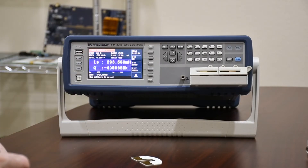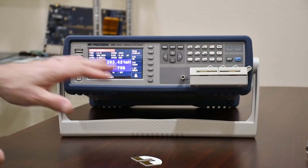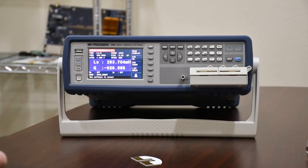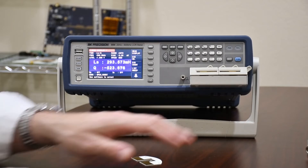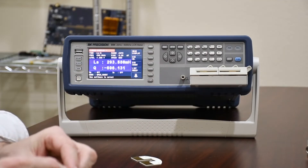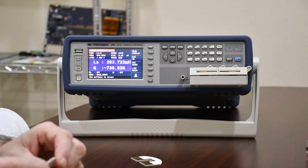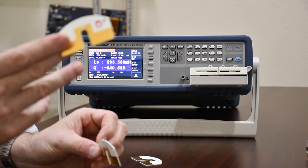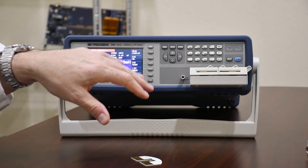It is an LCD screen here and I can't seem to focus on it precisely, but it should be good enough for this demonstration. I've already gone through the calibration and done a sweep correction using the zero meter cable length test fixture, sweeping through all the known preset frequencies. We're going to be using preset frequencies, so there's no reason to deviate. I've used my open and my shorting boards — they're marked — and I've got everything set up. We're going to take a measurement now.